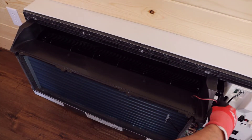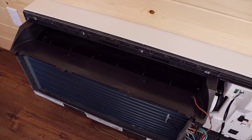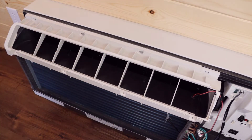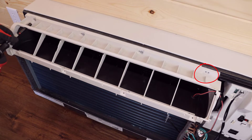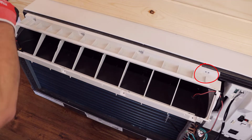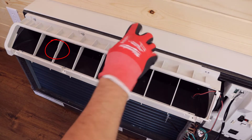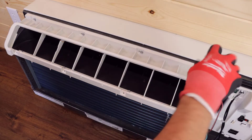Reinstall the air outlet deflector and route the UVC wiring through the wiring notch as shown. Secure the deflector with the original seven 5/16 inch screws. Note: the top right screw will be installed when the user interface is installed. Note: if installing an RAK-UVC2, reconnect the thermistor.